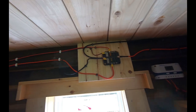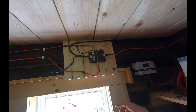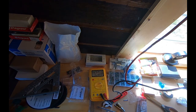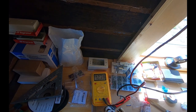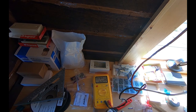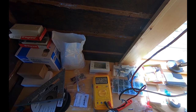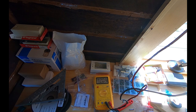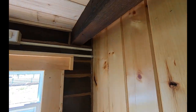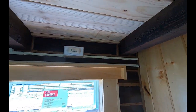I'll turn my power on and go check that receptacle. Here's the voltage back at the receptacle - it's running anywhere from about 12.06 to 12.5 volts. That's two out of three circuits out here into the main room. I'm going to take a little break this afternoon and I'll be back and we'll do that last set of outlets.